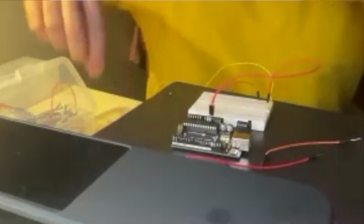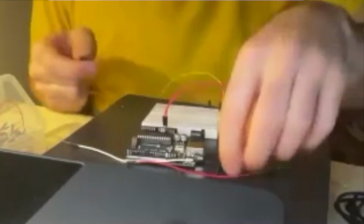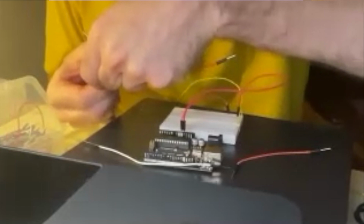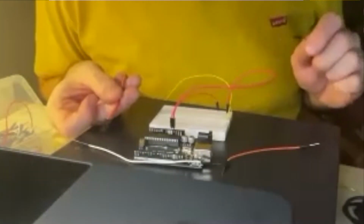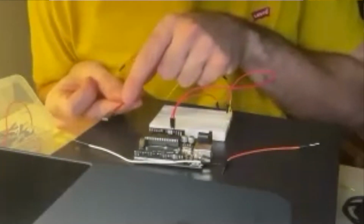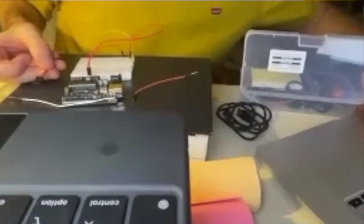And then I'm going to use a white cable for my instructions. I'm going to leave that there, but I'm going to finish off plugging in the power and the ground. So getting my Arduino right. I'm a bit colorblind, but what I can see is the 3 different colors. One's blackish, which might be brown. And then there's a reddish one, and then there's an orange one. So Sophie, could you just help me with the colors there? Yes, so normally black or brown is the ground one. Red is power, so the 5 volts. And then the other color is normally the signal.